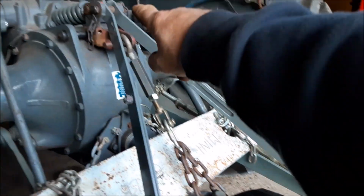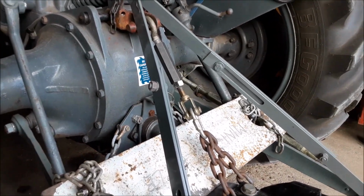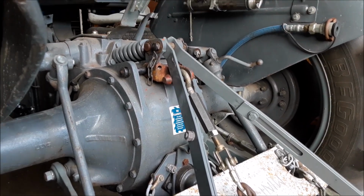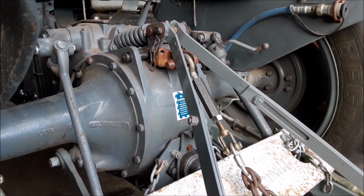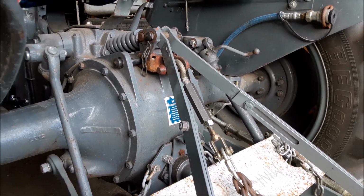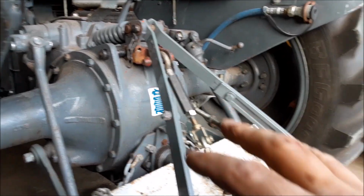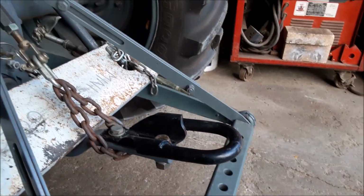It pulled the implement on this, so when you pull the implement, the implement wants to tip up, which pushes on the top link, which plants the back of the tractor into the ground. So you didn't have to rely on a whole bunch of weight to keep the implement moving through the ground. Whereas on those old drawbar tractors, they needed weight on the drive wheels to pull, because you're just pulling the plow off the drawbar to pull that plow through the ground.